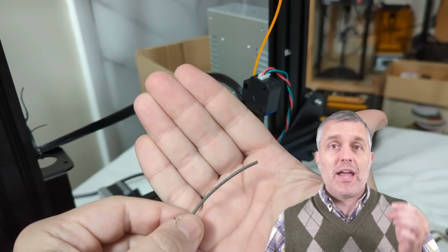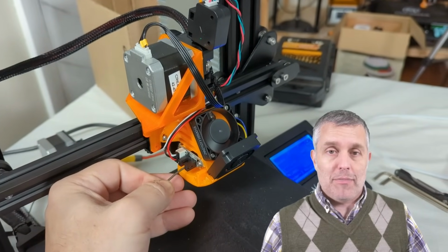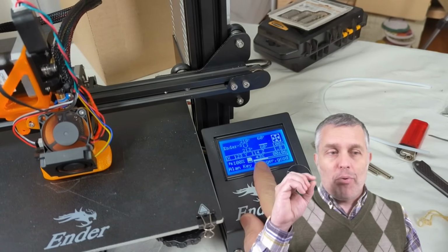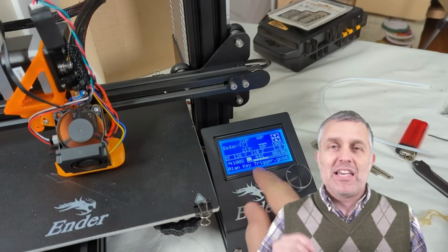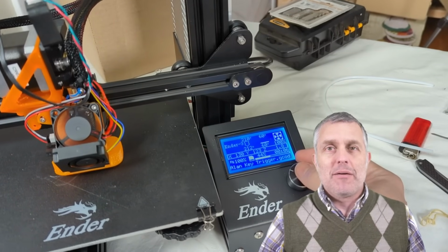But this dark gray PLA filament is able to trigger the optical sensor without a problem. So you will need to do the final print out of a similar material. Test it before printing. When printing the Allen key / sensor gate end piece, if you're using 0.25 millimeter layer heights, make sure you stop the print at right around the 45% mark.